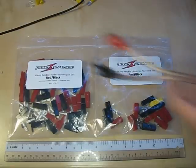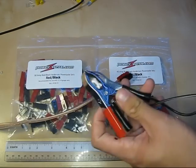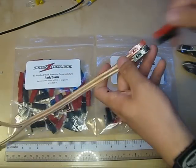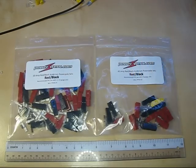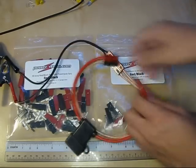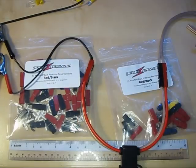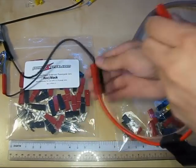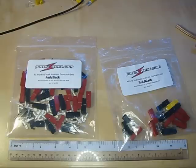Here's an example. I have made up a binding post to PowerPole and a clamp to PowerPole. So what I could theoretically do is plug one end to my power supply and one end clamped onto a battery and charge that battery. But what about fusing? I can just insert a fuse inline. That's why they're really useful — you can pretty much create any cable you would possibly want and then connect any device to any other device.